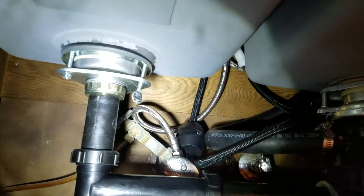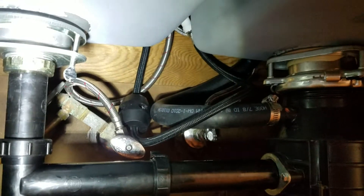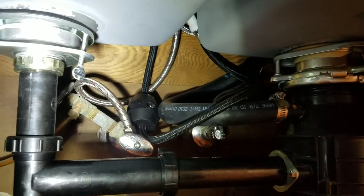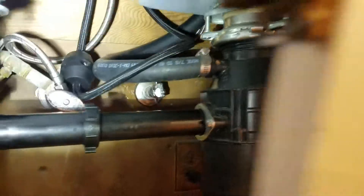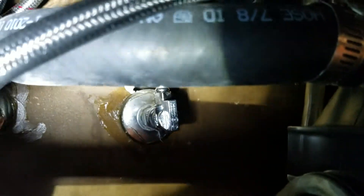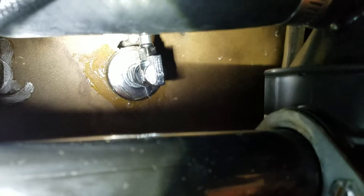Integrated supply lines into the faucet — the hot and cold braided stainless steel lines. Those are screwed into the faucet up top and come down tied directly into the shutoff valves. We did replace the cold valve back there. That old valve was a half inch IPS by half inch IPS, and the integrated supply lines are 3/8 OD, so we had the right fitting in our bucket of tricks and put that on.